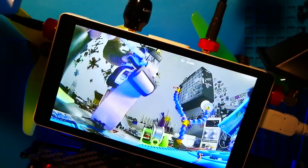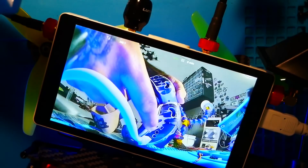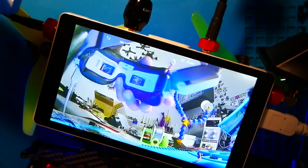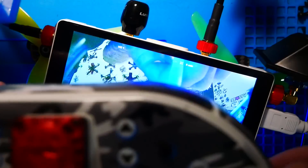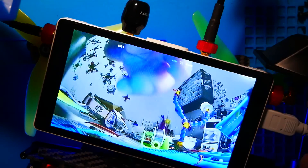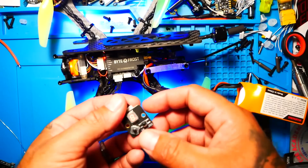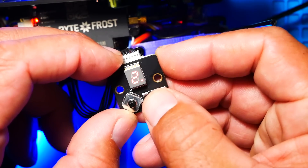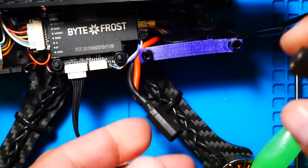To set up your goggles, plug in the HDMI cable to your goggles and monitor, make sure both are powered, then flick the little switch under your goggles and use the top button to scroll through AV, HDMI, and other input options until you reach HDMI. Anything displayed on the VRX will then appear in your goggles. To set maximum power, hold down the right button for three seconds — it'll flash the letter C — then scroll up to level 1, 2, or 3 and hold to save; it'll flash a quick '8' to confirm.